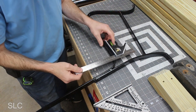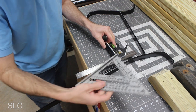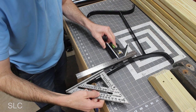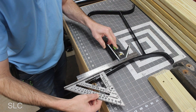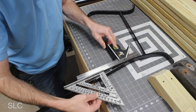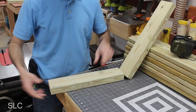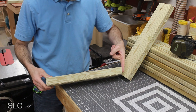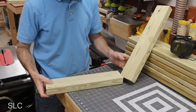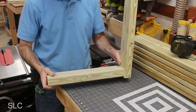I have a combination square I'm going to rest on the bottom of the seat here, and then a speed square I'm going to rest along the top. We're going to bump them together really slowly, then I'm going to angle the speed square out — and that is about seven degrees, so the angle is roughly 97 degrees. To make this support I'm using some pressure treated 2x4s; on the back I have cut a seven degree angle, and once I attach these two pieces together it should match the seat and provide some extra support.